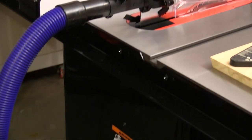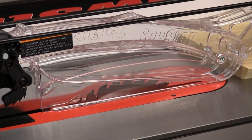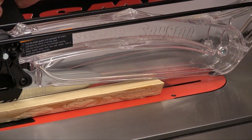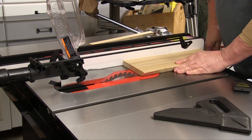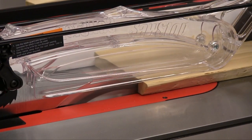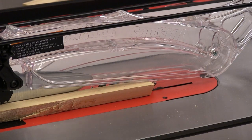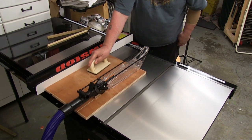It is time to see if this thing will actually cut wood. I have got the dust collection hooked up to both ports and we will show you how good this dust collection really is. Only the dust collector is running right now. Now we turn on the saw and you can hear that it makes hardly any noise at all over the dust collector. You will notice that there is virtually no sawdust left on the table. The blade guard is hinged so you can just lift that up and realign the fence to get the right cut on the board, then drop the blade guard back down and we are ready to go. We will make a second rip cut and see if we can generate any more sawdust on the table — and it does not look like it. Oh, there is one little speck. I can tell you all day long how good this dust collection is but it is better if you see it for yourself. Next I will cut a piece of luan plywood — this stuff always leaves a bunch of sawdust on the table. At least it used to.